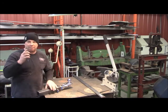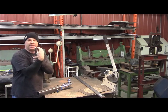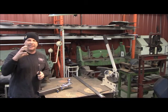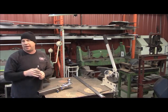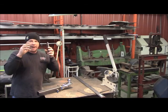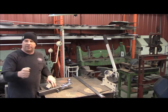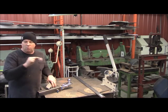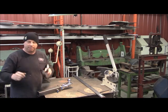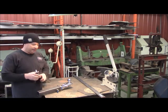What I'm going to do is make a plate that will go right to the back of that, and I can weld right onto the original piece that this receiver would go into — the hitch would go into — and that way I don't put any heat or stress in that unit, that bar across. There are a few times I may weld into that bar, that cross bolster, but I'm going to try to keep it all located around the weld and the original receiver hitch that's in there, because that's going to allow it to absorb a lot of flex and stress. Anywhere I weld on that bolster is going to harden it and make it not flex as much, and it could start cracking.